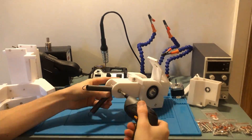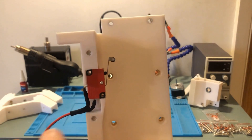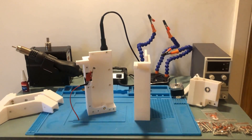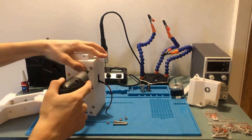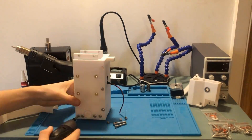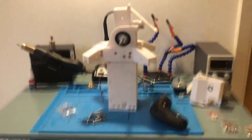The springs pull this central hinged part towards these large static parts. This red device is a limit switch and it will detect when the rail is in the upright position. Since stepper motors are open loop — meaning they cannot observe their output angle — the limit switch will provide a reference for up and stop the mechanism from trying to destroy itself.